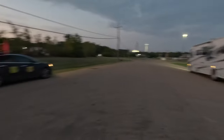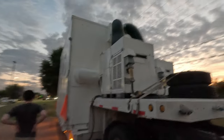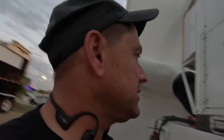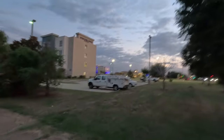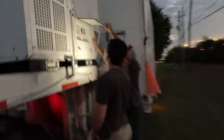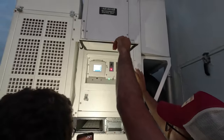I had one problem earlier. The motor wasn't wanting to run. It said it wasn't giving a signal on the G terminal. I went ahead and jumped R to G, got it running. But the problem is, when I reset it, it started working again. It's not a big deal. I don't know, it's doing the job. It's keeping humidity down now that the sun's gone down, though. The temperature's dropping pretty quick. Basically making it ride off for a bit all night. We don't really need to cool that much.